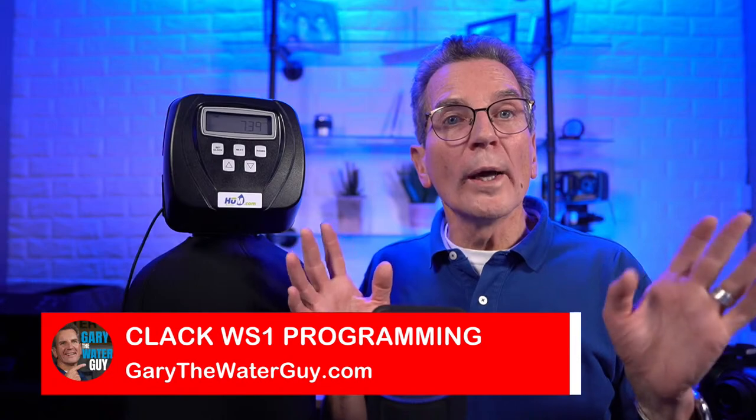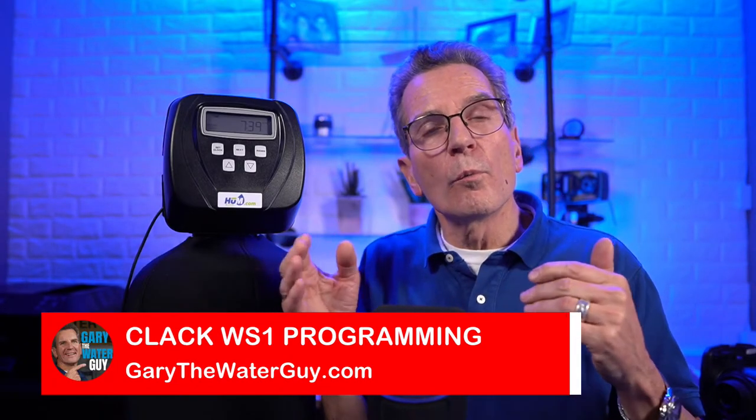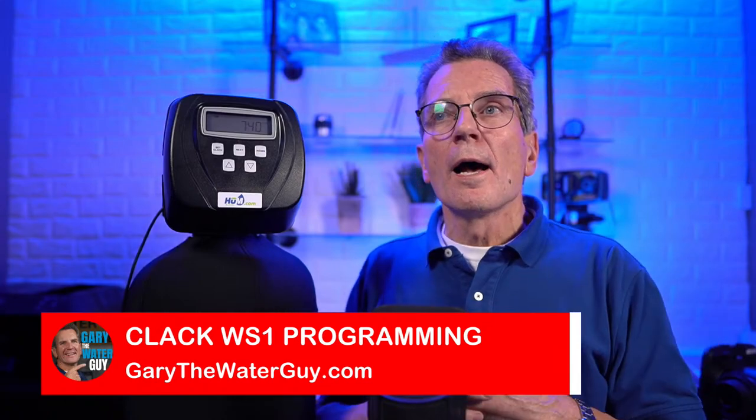But anyway, there are times when you want to have 24/7 soft water. When? In situations where maybe you've got multiple homes on the same system and people work shift work. Maybe it's a restaurant or coffee shop that's open 24 hours a day. Or maybe you've got a whole house reverse osmosis system and you want to make sure that you're never getting hard water through that system because maybe your water is extremely hard. Talking about extremely hard, if your water's hardness is 40 or 45 or more, a twin tank is definitely the way to go because you don't want to introduce any hard water into that system, because the hard water is so hard, it's going to raise the average hardness up quite a bit.